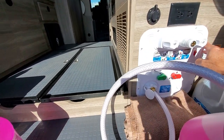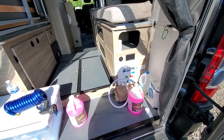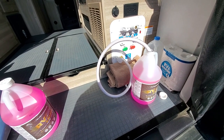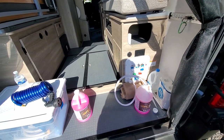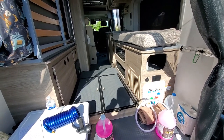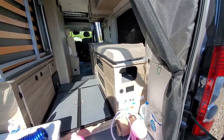Let's go ahead and turn the water pump on to begin pressurizing our system with the RV antifreeze. Here's the pump — let's turn that on. You'll hear it start, and you can see it drinking that RV antifreeze rather quickly. Now that the RV antifreeze has gone through the system and it's pressurized, we can go and pump that antifreeze through each of our water lines, specifically our water outlets.